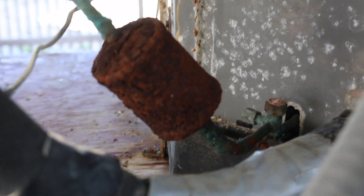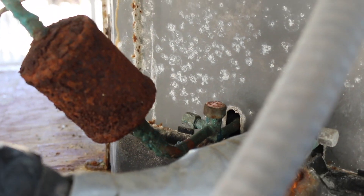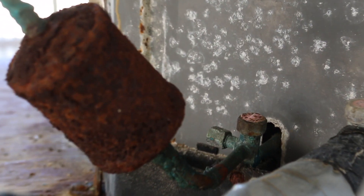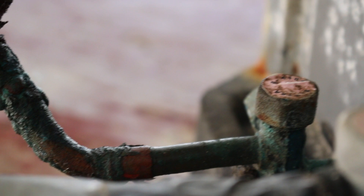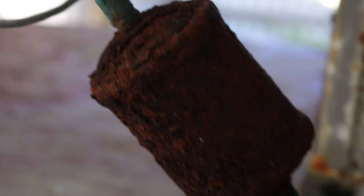Look at the filter dryer — and if I can get into that, look at it. It's a little oily there, if you can see. It's oily. I know it's leaking now. It's not working properly, not cooling, not getting cool enough. I know for a fact that's the culprit right there because it is good and oily.